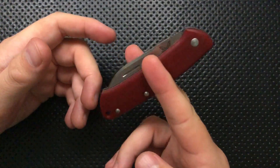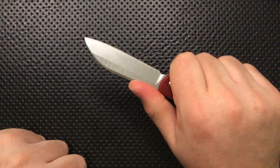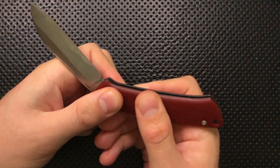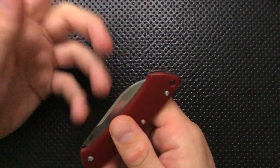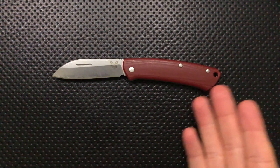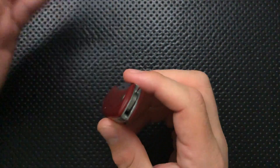Part of what bothered me — and something that will bother slip joint guys — is that the action on this guy isn't all that compelling. The spring feels a little bit weak, and it's not very snappy. It is very straightforward to just move this guy around with just a little bit of thumb motion, more so than some other slip joints I've handled. It does have a half stop, but it also has a three-quarters stop — like it wants to stop here and then here, and then it finally snaps shut. But there's not all that much snappiness to it. If you are used to a slip joint with a great walk and talk, this probably isn't going to impress you. I'd love to see a little more tension keeping this guy closed and a little more smoothness in the process. That said, this is Benchmade's first slip joint, and it's not all that bad for their very first rodeo.